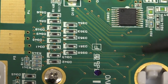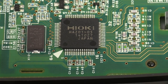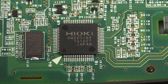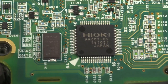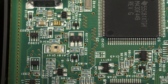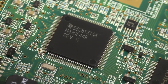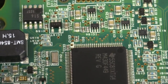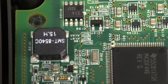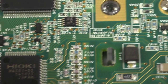Check out all the diode array there — they must be doing that for range switching. Under the shielded hood there's our Hioki-branded chipset, the HAZ0105. I doubt they're spinning their own, but it could be a rebadged one of the main multimeter chipset manufacturers. And there's our LED and photo receiver. And for all you MSP430 fanboys, there you go — it should be reasonably low power, MSP430 being the choice of low-power champions. That'd be our programming interface, and there's our little surface-mount buzzer.